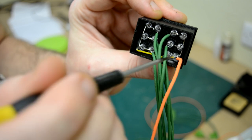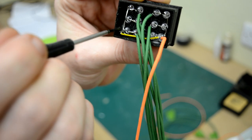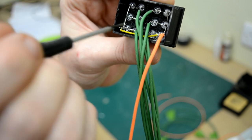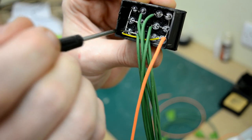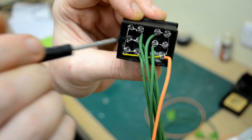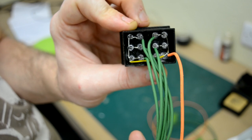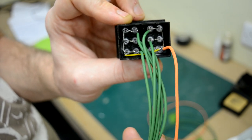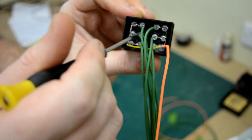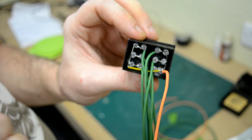And then this yellow wire at the bottom just links the positive from this LED, jumps the power across to the positive on this side, and then again the pins are then linked to the two LEDs above. So all six outside LEDs share the same positive line. And then the negatives, which are the inside pins of both sets, just have one wire soldered to them, which then will go to our DM13 driver. So at least it gave me an opportunity to show inside how it's been wired up. But I'm now going to replace the two blown sets of LEDs, and we'll come back and we'll do another test with the correct voltage.